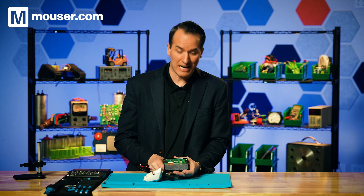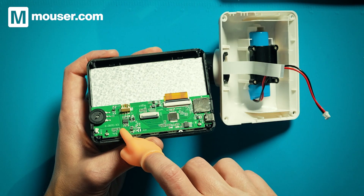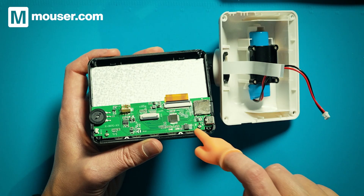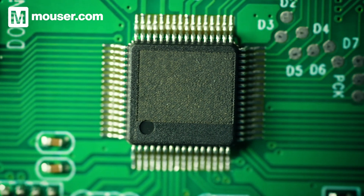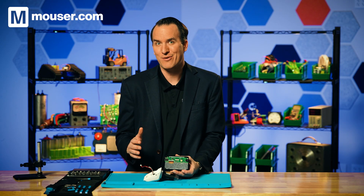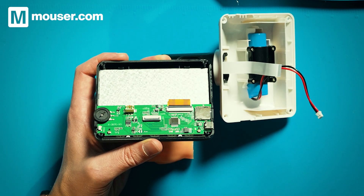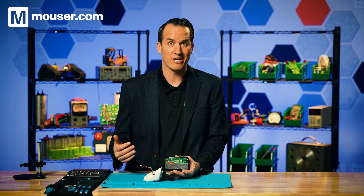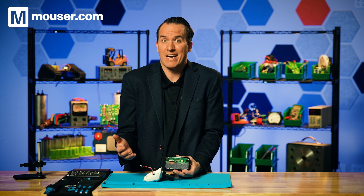Starting from where this battery was connected, I see a B2219D transformer. So essentially, this is where our power is coming from if we're running off of battery. There's also this chip in the USB system, and both of these feed into our microcontroller here. So I suspect the microcontroller is deciding whether it runs off of battery power or USB power. All the part information is lasered off — they do that so it can't be reverse engineered as easily — but it's a pretty good sized one. So I suspect all of the computing, all of the USB connection to computer, anything that's using logic is happening on this microcontroller. That will cost-optimize this whole design and keep it fairly simple.